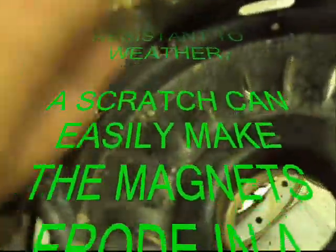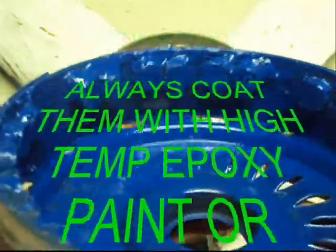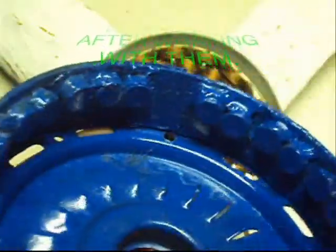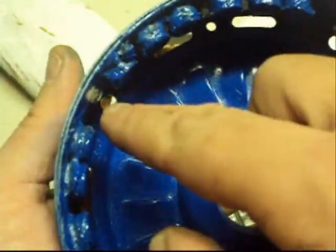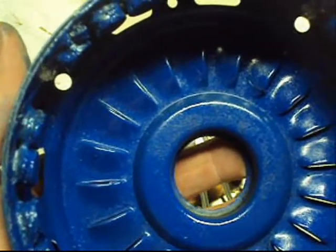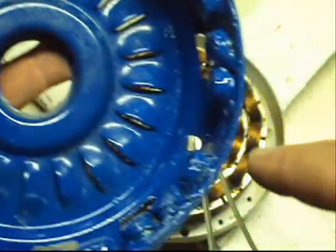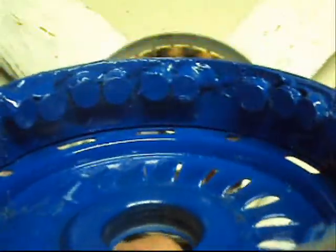Anyway, I'll see you in a few minutes. I'm Scott Brown with Green Wind and other home energies. I found some really high temp epoxy paint and I hit it at this angle to get this side of the magnets and this angle to hit this side of the magnets. If you notice here, I'm missing magnets here, here, here, and also over here. That's where the bolts are and I didn't have room to stick them in — it's only missing part of the stack. Like this would be north and then this should have been north, but it's gone. It's exactly evenly weighted on both sides all the way around, so that doesn't upset the balance of it. That's what's important. This high temp epoxy paint will hold up for a long time and keep these magnets safe.